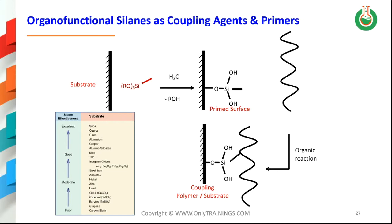On this chart, it's important to know the type of substrate you want to functionalize. On this list, you can see from the bottom to the top of this table, substrates that do not react with silane, up to silica or quartz — silica-based minerals. They are very good substrates for silanes to react with, so it's important to know this if you want to functionalize using a silane formulation as a primer on those substrates.